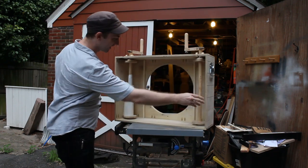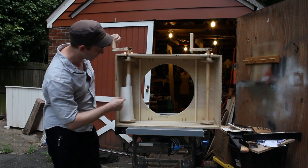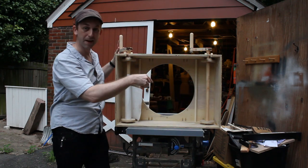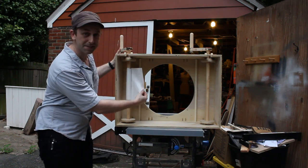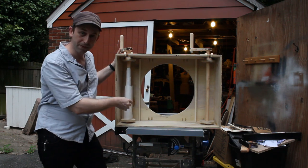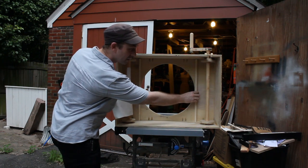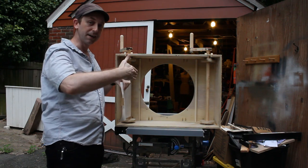If you look around the back you can see that it has two scrolls — one that you load up on this side, and the other one which is empty, that you attach the other side to and crank from one side to the other. This is a little bit of test Tyvek; it's not the right width that Matt's scroll is going to be, but I had it in the workshop. You can also see there are a couple pieces of PVC pipe here that are free to rotate, and those keep the tension against the screen.